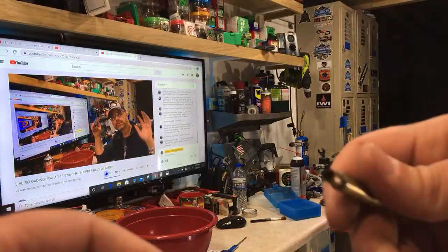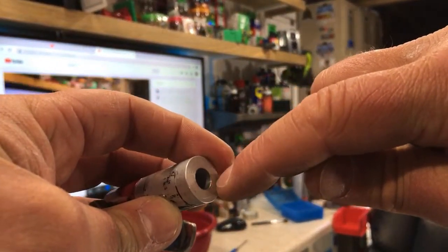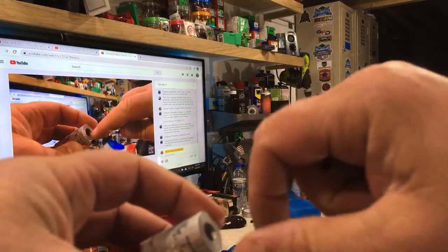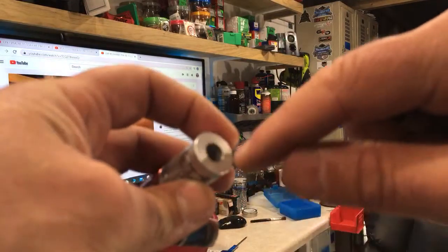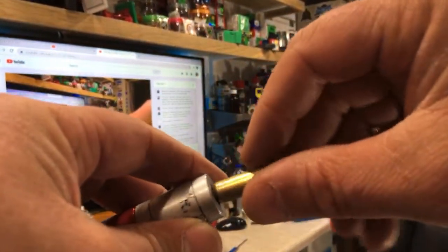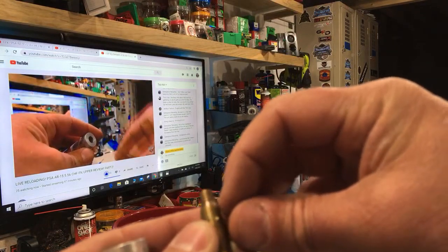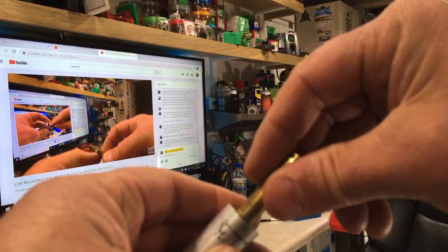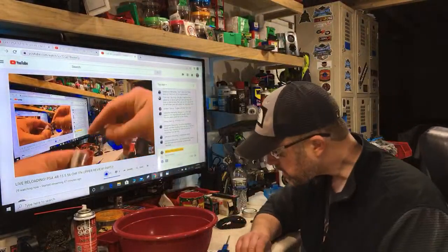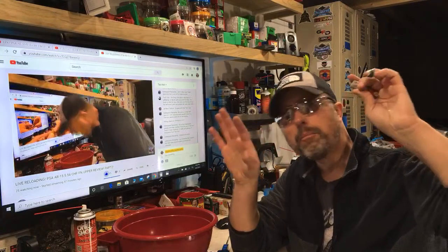They try to get this headspace gauge, the insert, there's a little bevel on there. There's a little bevel on the inside of the case gauge where it rides on the datum line. Well, one might have a little bit stronger bevel than the next, or this might be an old insert that I've spun brass in quite a bit over the years, and it's kind of worn it down. Mine will definitely read different than your insert. All that's doing is riding off the datum line, the middle point where the body starts at the shoulder. The middle of that shoulder is called the datum line, and it rides on that case gauge. Your calipers are reading true and they're accurate, but your bump gauge, where it rides on the datum line, might be a little off.